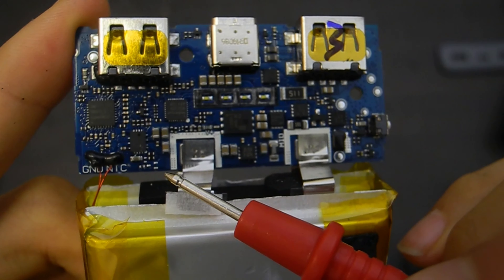Now it's time to repair it. The USB connector wouldn't charge or discharge, so I disconnected the battery and reconnected it — because a restart fixes everything. The tester now recognizes it as a 45W PD charger, and other voltages also work. It does support 45W max, but it's kind of a clickbait because 20V is 40W max, and most devices only support 20W. So it's technically 40W only. Let's test the current capability.